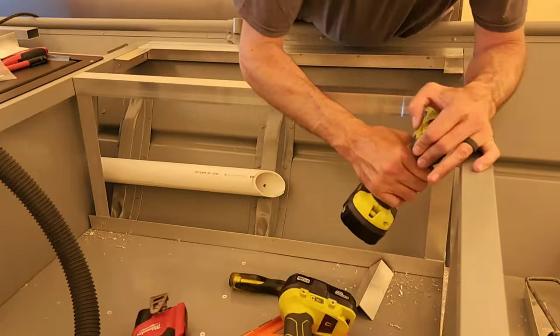I started taking the decking back off to begin adding more framing back in. The boat would need angled aluminum ledgers the length of the boat to catch the decking edges, so I began installing those. These would need to be custom bent to the angle of the hull. The framing spans up front were not sufficient to support the decking without flex, so I added extra framing within the voids. And man, looking back, I really wish I had the capability to weld aluminum at the time of this project, because riveted aluminum framing is tedious. Knowing what I know now, I don't know how I did it without a welder, but I've always found a way to make it work.